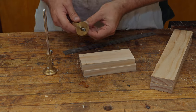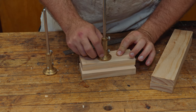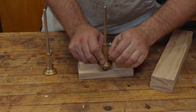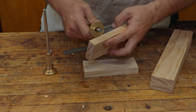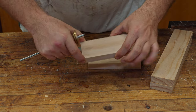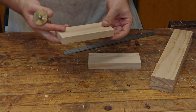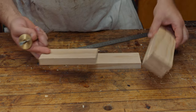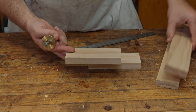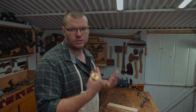When I try to get the entire thickness I like to use the actual pieces to get our thickness if you're using one of these style of gauges. You can run it off the edge, let it drop down, lock it off and it will be the exact thickness of the piece. With these pieces, both the sides and edges are all square to each other so I don't have a particular reference edge or face. If you do have a reference face or edge, you obviously want to be using them to do your marking off.